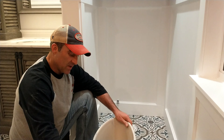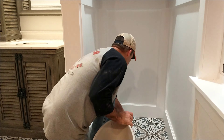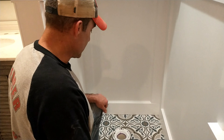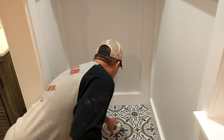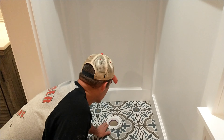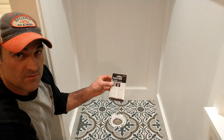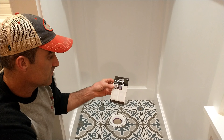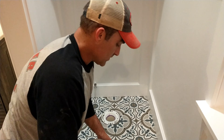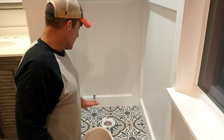I've got the toilet out. I got the base here and I'm going to dry fit it in this area. I got the flange hole and I have a plug in it — I'm going to remove that. If you have a rag in there, make sure you take any rags out. We've got this plastic flange here and I was trying to get it flush with the tile but it's sticking up a little bit, so I did get some plastic shims. These are for leveling up a toilet — about three dollars from Home Depot. It comes with four and I just figured I may need them to level the toilet up. So I'm going to dry fit this in there before I put the wax ring on just to see what I need to do.